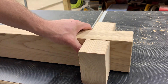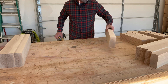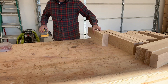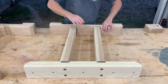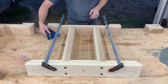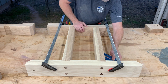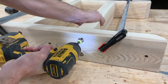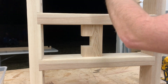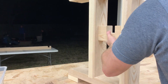You can see how they're going to fit together. Now that all of our base pieces are cut, before we assemble anything, we are going to sand it all — because remember, our goal is not terrible. Now we're going to put the base together. We have all of our pieces, everything is countersunk. Put it in some clamps and check square just to make sure that everything is good. It is, so we take some big old honking screws and screw it all together, but we do it so nobody will ever see. These screws go into the stretcher — I just use some three inch screws — but those screw holes are going to be covered up with our angle pieces.